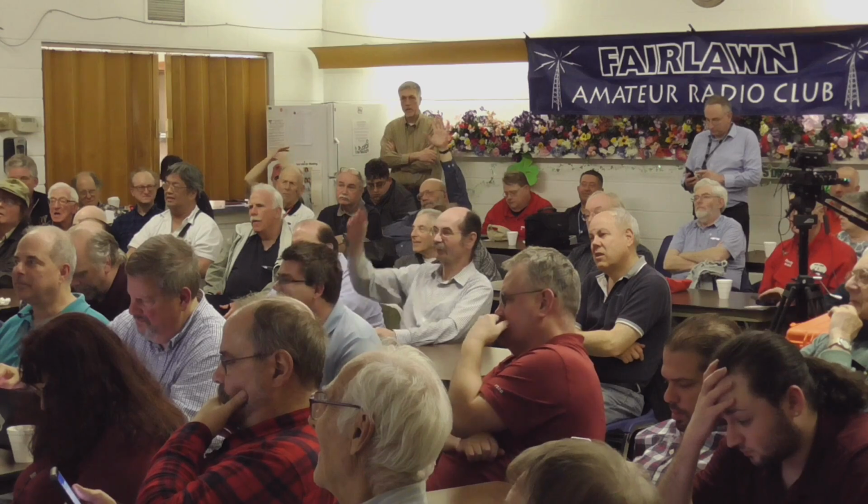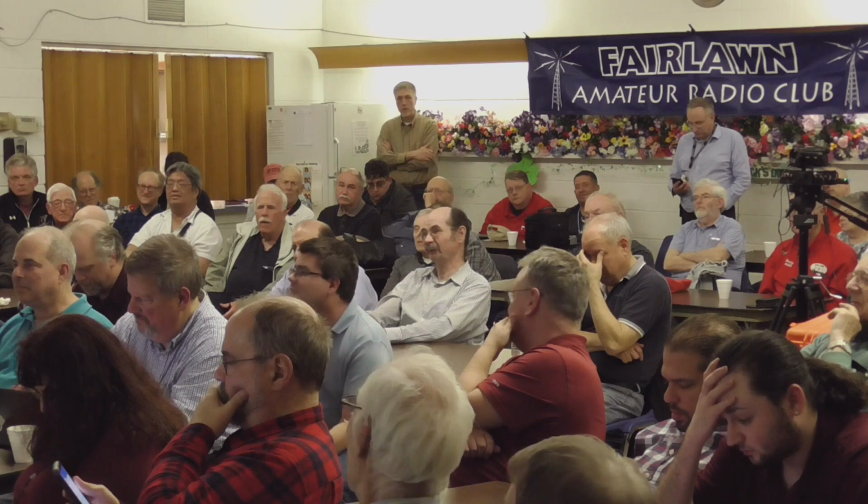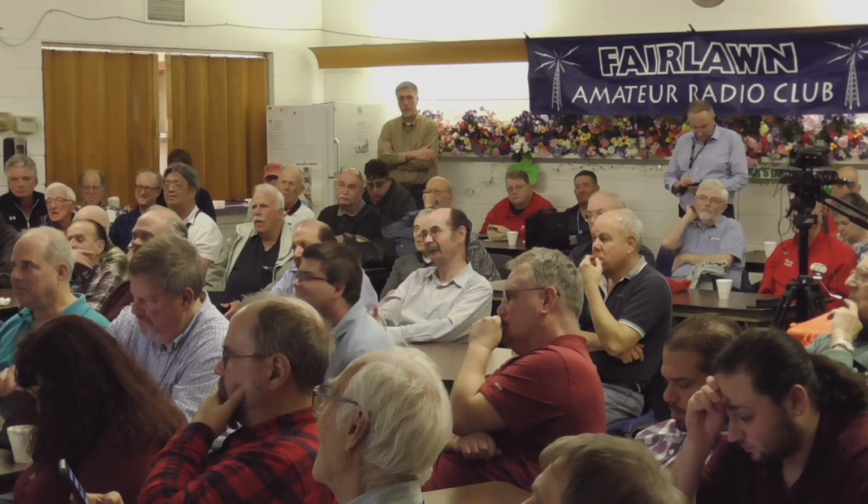If we're doing moon bounce, do I have to set my computer's clock a little bit ahead to compensate for the delay? No, the program knows that. There's actually a box to check which says insert EME delay. It's only 2.5 seconds, and in any case, when you're working JT65, which is what you would use for moon bounce, it searches from about -2 to +5 seconds, so you'll probably get him anyway. But it's best if you're doing moon bounce to look in the manual under EME, and it'll tell you to check that one box that extends the positive delays by a little longer.